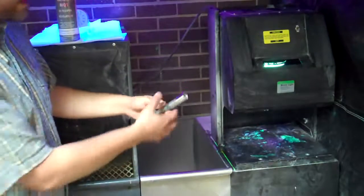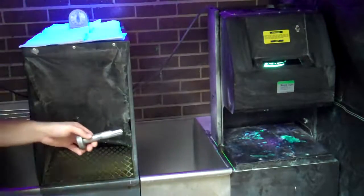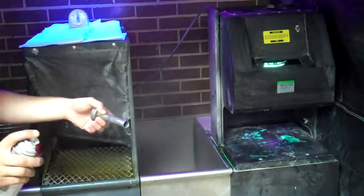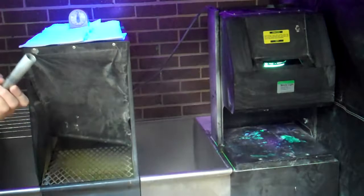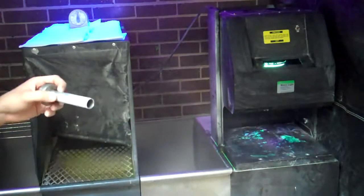So I pull my part out — looks dry to me. I'm really only looking at this end down here. So I shake up my developer here — I'm using Ardrox NQ1 non-aqueous developer — applying light coats, getting a nice white contrasting background, which is what we want.